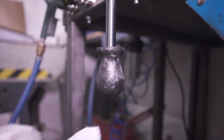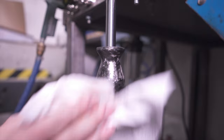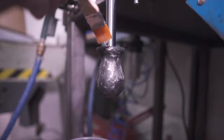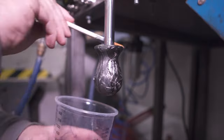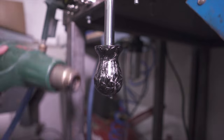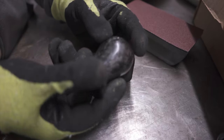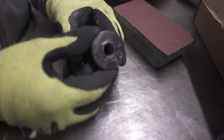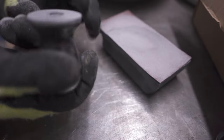Due to some small holes and gaps, I decided to give it a coating with XCR coating resin. It's a great product, and it's perfect for these kinds of jobs. With the resin cured, I had to get rid of the drip and the uneven bottom surface. I sanded those off by hand, and then it went back to the drill press for its final sand before clear coating.